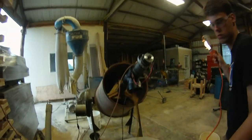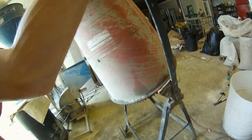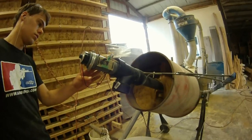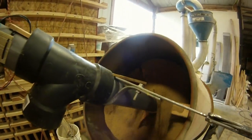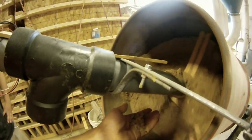The feed system is really exciting. If you saw the last video, that last bin with our minerals and meal wasn't feeding correctly — we weren't getting good flow rate out, and we were going to put spinners into the bin to throw the material into the auger at the bottom. While we were working on that, Christian, my younger brother, said we're going to put all this stuff into a concrete mixer anyway to mix it, so why not just put an auger inside the concrete mixer — have it all in one spot, take up less space, and serve a dual purpose. That's a great solution.